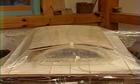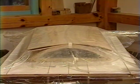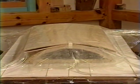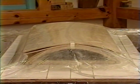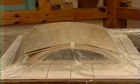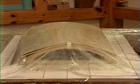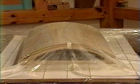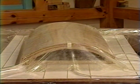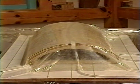One nice thing about vacuum is you get to watch what's going on, so there's always time to adjust things if you see a problem. Sometimes I hear people wanting a really large vacuum pump so it will suck things down almost instantly. I think this is a bad idea. No time to make adjustments. Remember, the speed of the pump is more about staying ahead of the glue's tack time than anything else. That's another reason I prefer a slower setting glue. I'm not in a rush.